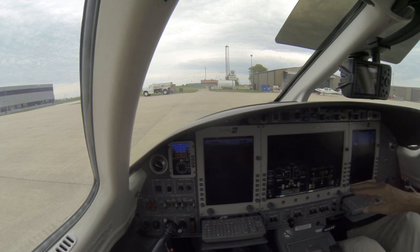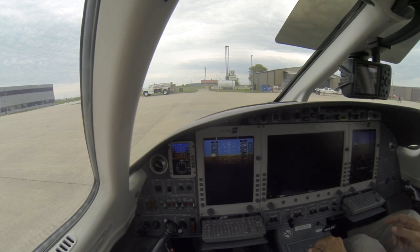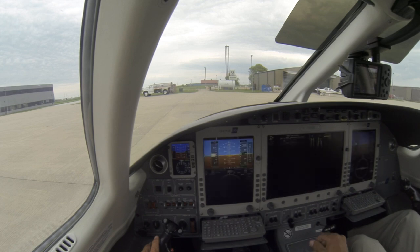But the other thing you're also doing with it on is you're recovering the start battery. Because we're using a bunch of the start battery and a bunch of this generator in combination to start that motor. It's all about heat, trying to reduce heat to extend life and reliability.